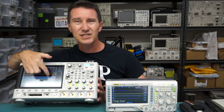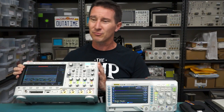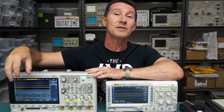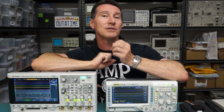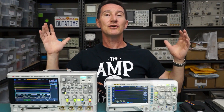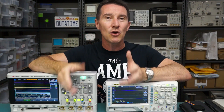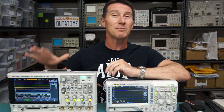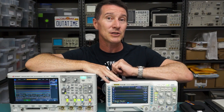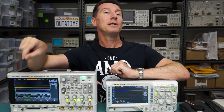The other thing is that these screens are really, really cramped. If you try to jam 16 digital channels plus your 4 analog channels on there, you're really pushing brown stuff up a hill with a pointy stick — trying to fit it all on this screen. Logic analyzers is one area where hooking up to a PC has massive advantages — absolutely massive advantages. You can have a massive screen, you've got your mouse as a better user interface, much better search capabilities, the keyboard, the mouse, everything else — much better than poking around on an oscilloscope. So while the mixed signal capability in these scopes is very handy, they are very fiddly to use compared to a PC-based logic analyzer.